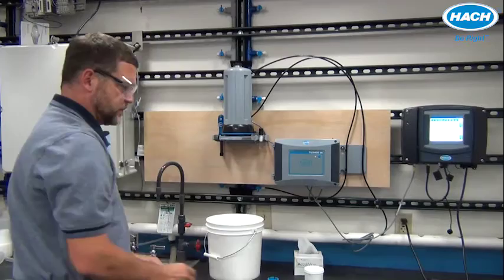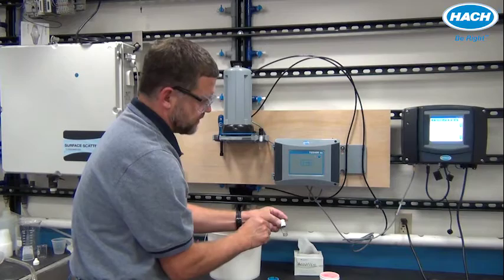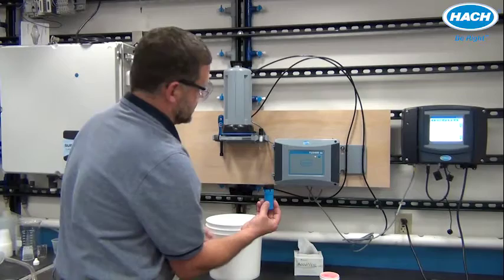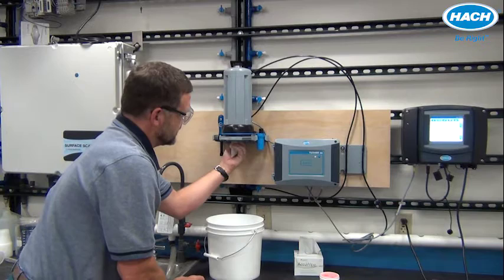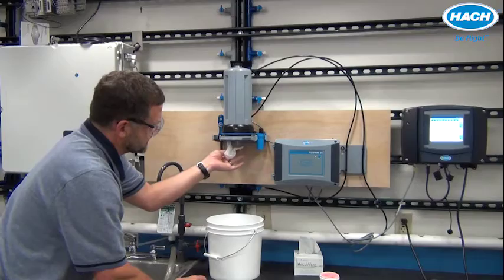Open the container to grab the new vial, being careful not to touch the outside of the vial with your fingers. Place the vial into the container and use the removal tool to screw it into place inside the system — make it nice and snug. Then take an AccuWipe or a very clean cloth and polish the full 360 degree measuring perimeter on the outside, as well as the bottom optical surface through which the light is directed.